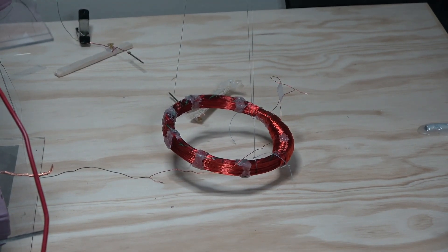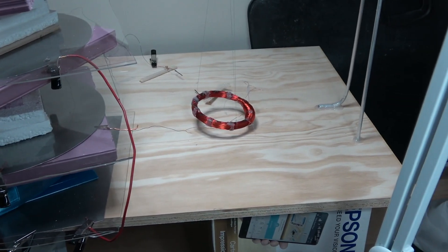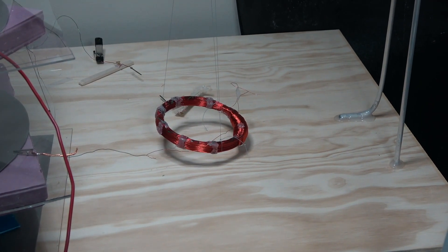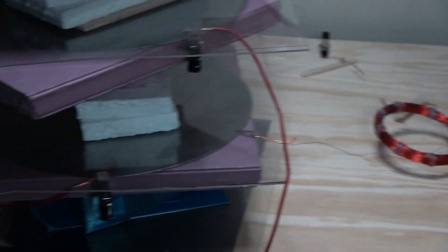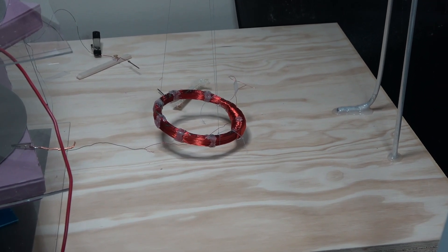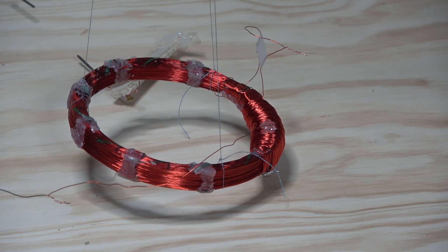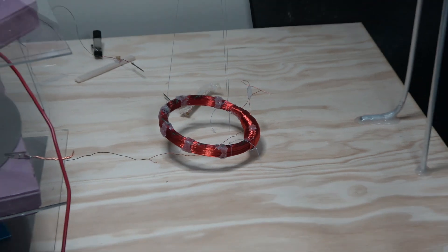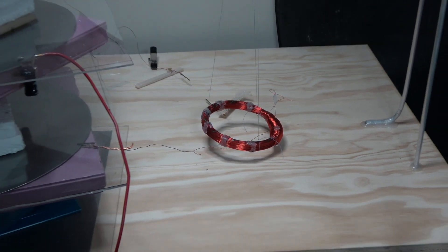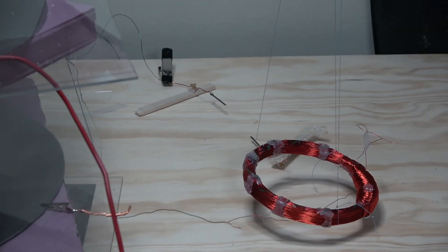A bigger arc would cause a greater surge of electron flow through the coil, causing it to move more. For my next video I'm going to make sure the coil is far enough away from anything magnetic to rule that out. I'm pretty sure the sheet metal is magnetic. Right now I have the two coils in series — a different option would be to put them in parallel, which might be more effective.